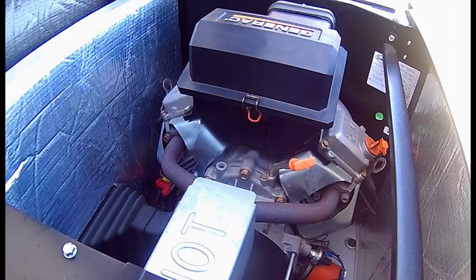It costs pretty good money, not 100 grand, but 10 grand for a complete setup. But like I said, you can run this on propane if you want to. I was thinking of having an independent propane tank off the natural gas supply, simply because if they cut the natural gas supply for any reason, like hitting the hydro poles, you're out of power. So you can run it on propane from the tank and fill up the tank once a year. Have a dedicated fuel tank, maybe 500 gallons or something.